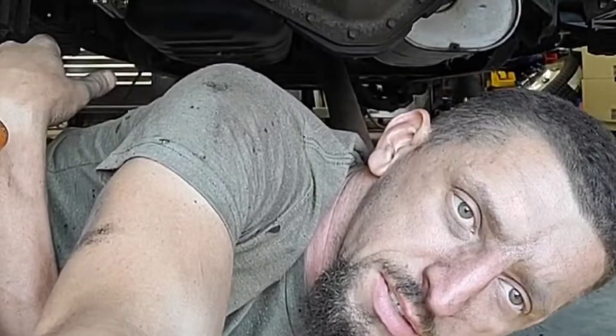I put the truck all the way down to the lowest possible position with the leaf springs, and then we're using the airbags to give him the lift he needs. The leaf springs are handling axle location, and the airbags will be the suspension. It'll probably ride pretty rough in the rear unless there's weight in the back. I'm curious to see what happens. I'd also thought about taking a couple of springs out of the leaf pack but I really don't want to do that either.